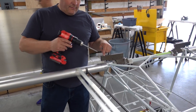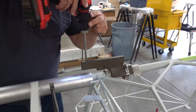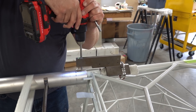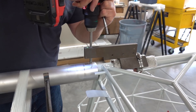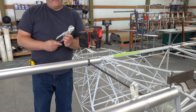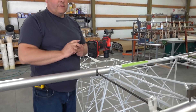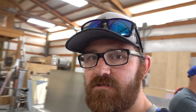We have our drill guides, which we've pre-aligned to the front bolt hole. Now do these come in the kit? These do not come in the kit — this is a factory rig option. We use a spacer to hold that rib spacing, and then once we drill the back hole, we take that pressure off. This hole's already aligned. Is this factory rig or part of the kit? This is factory rig. So they've got all the trick tools to do this simply and correctly.